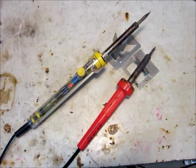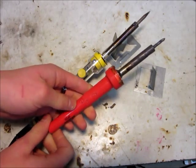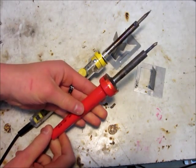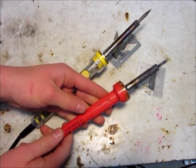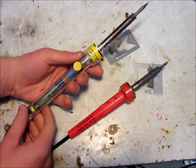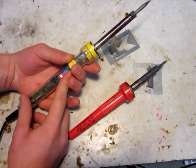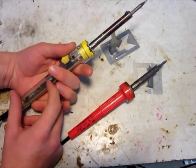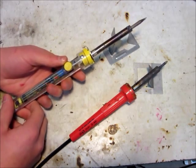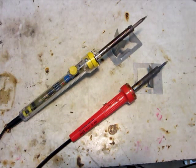If you've never had a soldering iron before and you want one, this 25-watt standard Radio Shack soldering iron will probably do what you need. I've had this one for a few years and it served me well — they're about $15 at Radio Shack. If you're looking for something a bit nicer, this is a 60-watt temperature-controlled soldering iron. It can be controlled from 200 to 450 degrees Celsius, and it has a really nice tip — if you loosen this little screw you can pull it out. I bought it for $30 from Electronic Gold Mine, an online website. They sell some really good cheap stuff. And I think that's about it — thanks for watching.